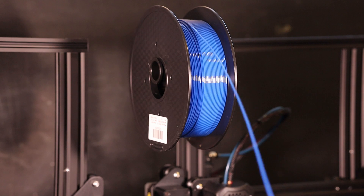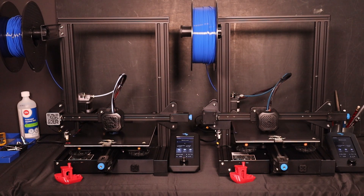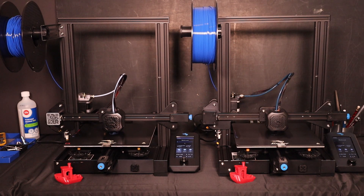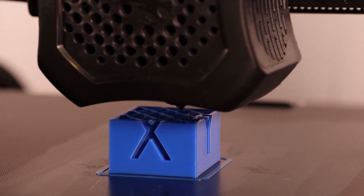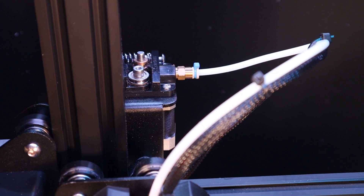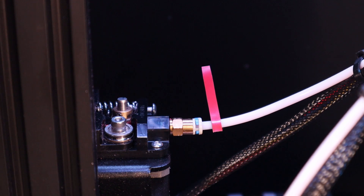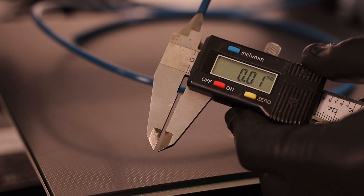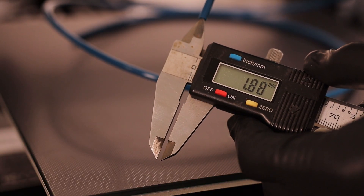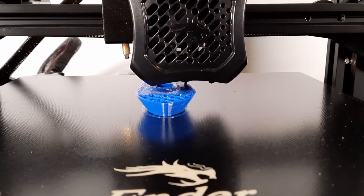We can repeat the same test on a new roll of blue PETG, this time separated from the same spool for more accurate results. I'm also going to add an XYZ block for each printer in the same blue. I wish I had the original Bowden tube for this printer — I had some issues with it moving in and out, so I replaced it with Capricorn tubing, which has a smaller inside diameter. I suspect that might be causing some of the stringing, so I've swapped them out and will run the same Benchy tests again in blue.